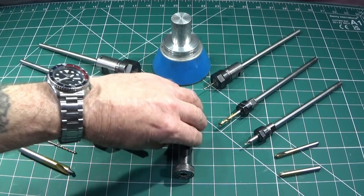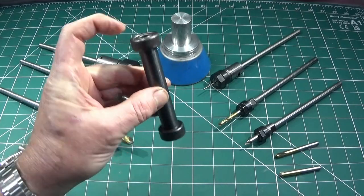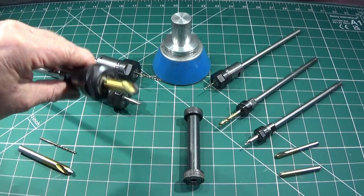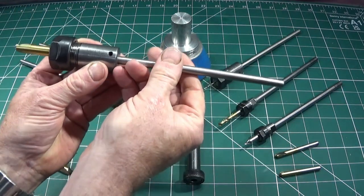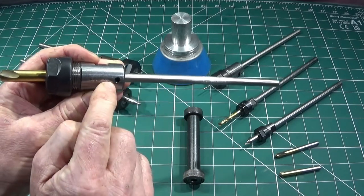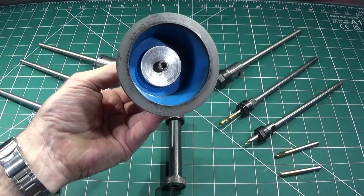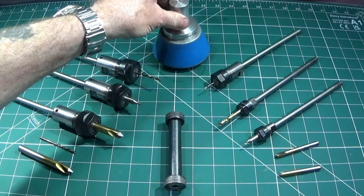You need very little equipment to do so. You need one of these tool post drills that I've made here, with an 8mm roller bearing in each end for an 8mm spindle, some collet chucks - this is an ER20. I have ER16 and ER11, and these ones can be simply fitted to a piece of bar. I've got 8mm stainless steel here and it's just locked in with a grub screw, and this one obviously fits my tool post drill. Also you need a diamond cup wheel - you can get them in various different grades. Make up an arbor; I've just made one out of aluminium to fit a collet chuck, and that's about it.